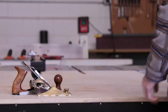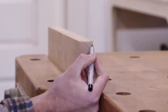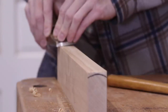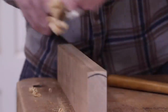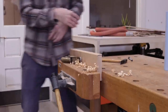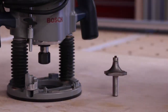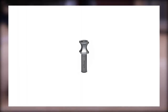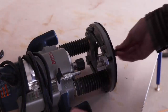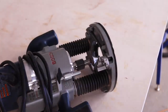There are a few different ways to achieve this look, both with hand tools and power tools. The quietest way would definitely be to use hand planes to finesse the shape along an edge — very relaxing and a pretty good result, but a little slow for my liking. If you're looking to speed things up and do it the easier way, a router and some router bits is my preferred method. There are router bits specifically made for this task, but the way I like to do it is with a big round over bit — this one is a three-quarter inch radius.